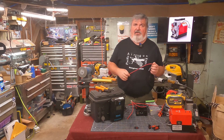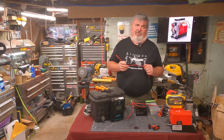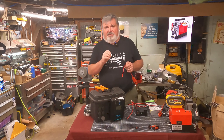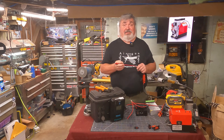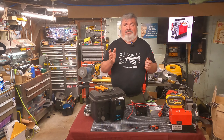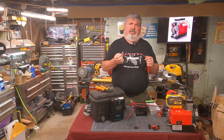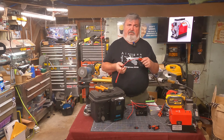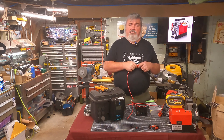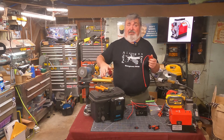There was once a great debate early on in large-scale power distribution near the turn of the previous century that saw two very famous men pitted against one another: Nikola Tesla versus Thomas Edison — AC versus DC. The wreckage that Edison left behind pursuing his ideas is actually quite horrifying, and in my opinion tarnishes his memory. History notwithstanding, high current DC distribution needs lots and lots of copper. I use the 50 amp SB50 connectors on the vehicle side of things and short runs of 8-gauge wire fused for 40 amps. If I was stretching this out to the tailgate or to the bed, I would have increased that cable one or two sizes at least.